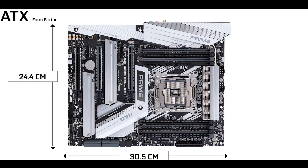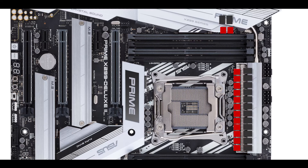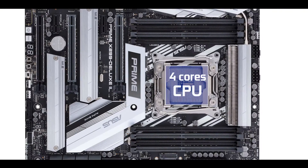It is powered by an LGA 2066 CPU socket, which can support all of the X-series Intel Core processors. VRM-wise, it gets a little confusing — Asus has been a bit tricky when talking about VRM and power delivery. They're talking about 12+2 power stages, and that's technically true, but there are only eight phases feeding them. So no big improvement compared to the Prime X299-A and Deluxe. I don't foresee any thermal throttling — this board can handle any CPU and almost any overclocking — but I do regret that Asus isn't being fully transparent about the phase count. Twelve power stages, sure, but only eight phases — that's an important distinction.